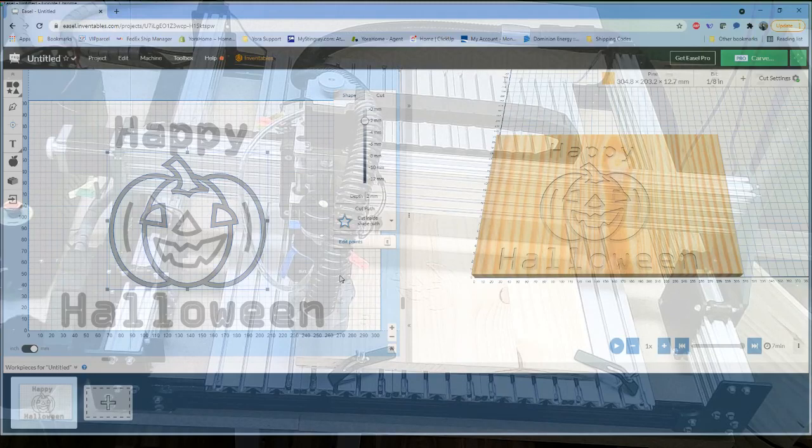If you want to cut all the way through something, one thing that we highly, highly, highly recommend, even if you have the original MDF spoil board, is place another sacrificial board underneath the material that you want to cut out. Because when we tell it to cut all the way through an item, it is going to run the bit deeper than what the material is, and it will drive the bit into the spoil board. If you have the MDF spoil board, it will cut into that MDF. Maybe not the end of the world, but still not something you want to destroy your spoil board if you can at all help it. Since this machine has the aluminum spoil board, we would definitely be using a sacrificial piece because we don't want those bits to gouge into the aluminum and potentially break a bit. The speed settings that are cutting through wood would certainly not work for cutting through aluminum.